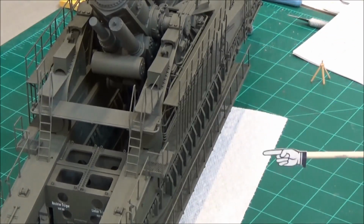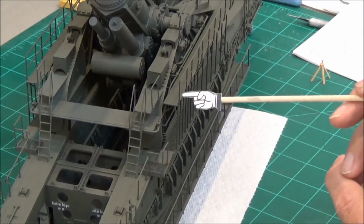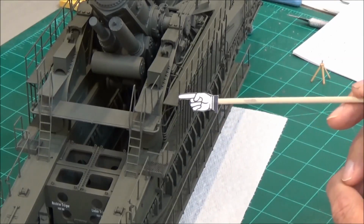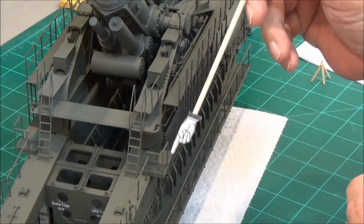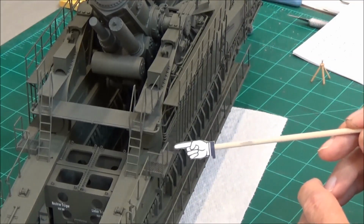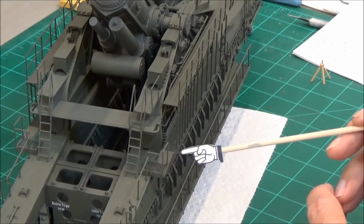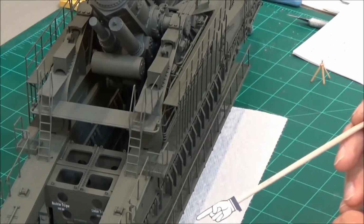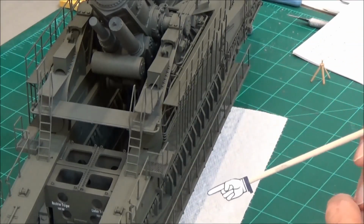Well, they got railings all over the place, okay? But there's no railing here on the end between this platform and this platform. So if a guy comes running down this railing trying to get off the gun and makes a misstep, he's gone. Same way down here. There's a big gap between this railing and this post here. That's a fall hazard. And not only that, a trip hazard and a fall hazard. So I've seen some things I don't think OSHA would approve of.